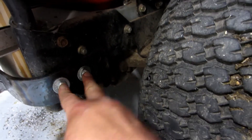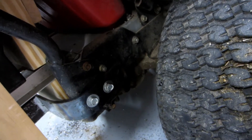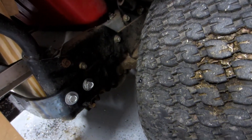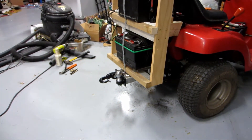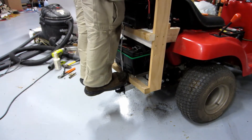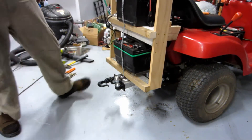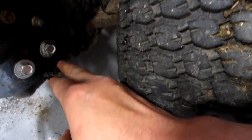I know from experience these shear immediately — they're very mild steel. I heated this up and let it cool down at room temperature, so this is probably essentially annealed and a bit soft, though I still think for these purposes it should be fine. Generally, the tongue for a trailer should be able to hold about 200 pounds, and that's what I weigh, so let's see if it'll hold me. Yeah, as expected, the weakness is those bolts. I dare not tighten them down any further either, because they're such mild steel — I know if I keep turning them, they'll simply snap in half. They're so soft.